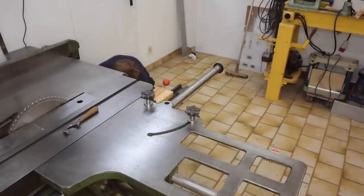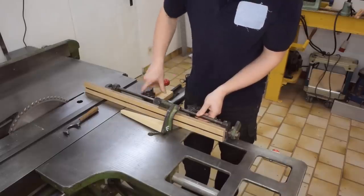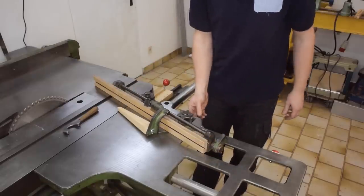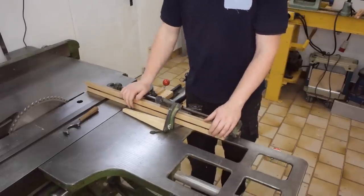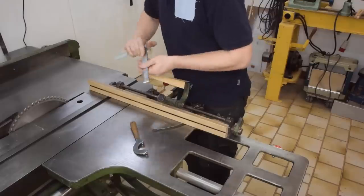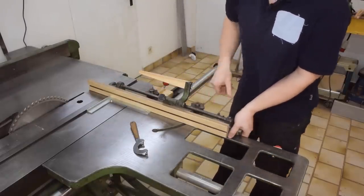And then if I want to make cross cuts again, I need to lift the fence back onto the saw. Get it in here, then tighten those special knobs. And the problem is there isn't really a 90 degree reference point on this table. Technically it has a bolt here that I can adjust and that should stop it, but that is really unreliable and not very accurate. So what I resorted to is to get my square and square the fence off against the miter slot like this, fiddle around, get it just right, and then tighten down the knobs all the way.